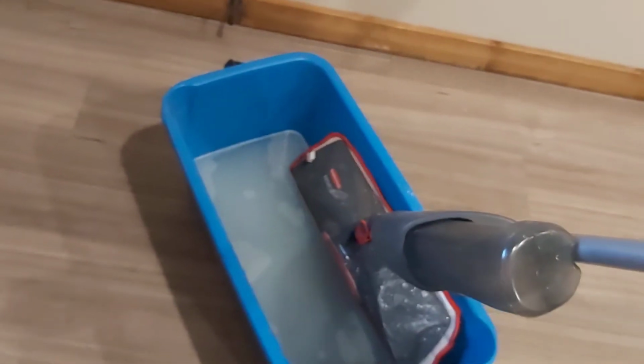Alright, so once you've done that, the problem with the magic eraser is when it dries, it leaves a little bit of residue, and it looks like all these paint patches. And so the final step for walls is we fill a bucket like this with soap and water, and then we use a floor mop with a low profile hinge like this, and we go over the entire wall.